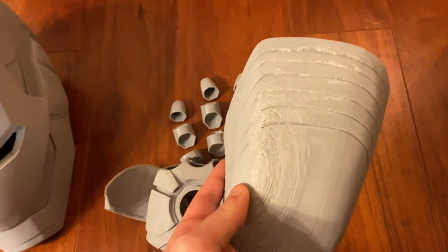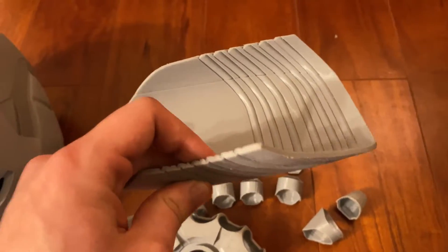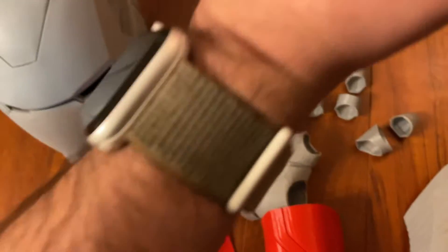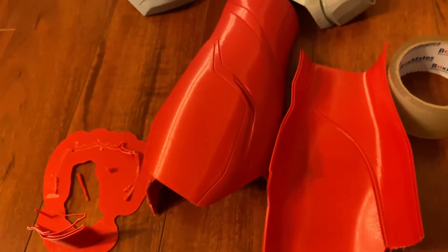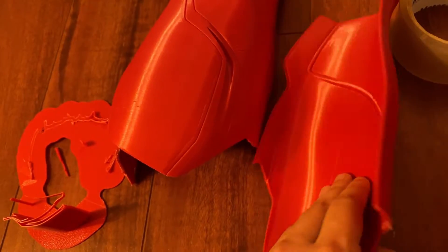This is the top cover for the arm again — my embarrassment. Never print this way. This is how it was printing, going flat, and it just doesn't do well. There are a lot of bad spots and these parts are overhanging — no bueno. Go vertically up as much as you can. Printing like a vase going up will probably give better results with minimum filament — and it did. When I took them off the bed they immediately came apart.